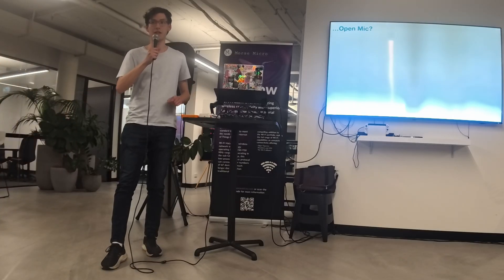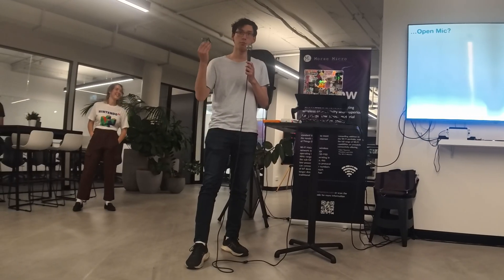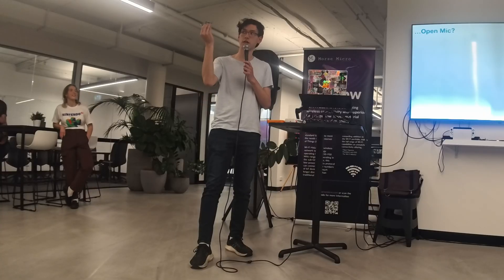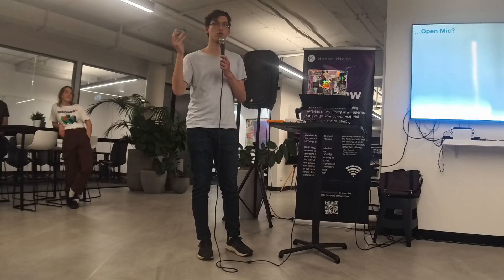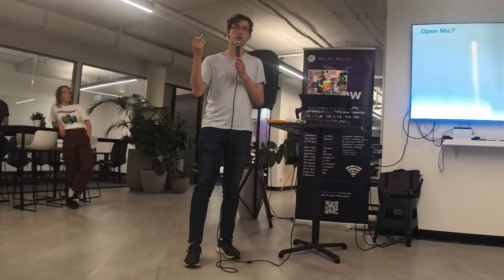Hey guys, I'm Will — I'm the guy who was asking about the buck converters. I've been working on a portable platform for the Raspberry Pi 5 compute module. This is it right now — a board that integrates a LiPo battery charger, dual MIPI display, modular port for controller expansion, and USB hardware, all onto a compute module 5 for portable applications.